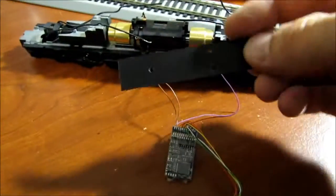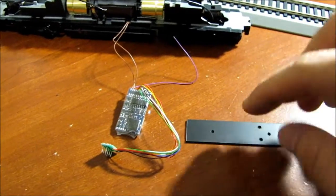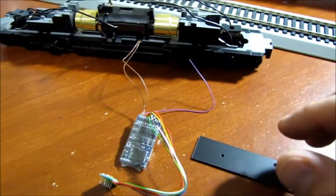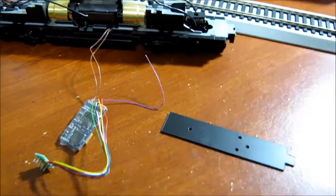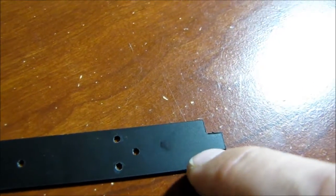And the initial sense is I'm going to put this on top there, then just glue, tape, whatever, that to this right here. You screw it down, put the 2 motor pins that are going through the board up through there. Then once that's all said and done, cut this wire harness, solder the wires to the appropriate sections, and then what I'm going to do, I haven't pulled any out yet, is get the LEDs that I want, none of those orange ones, and just glue the LEDs right to the board here.